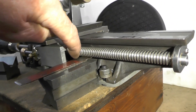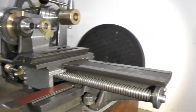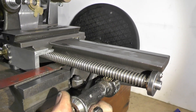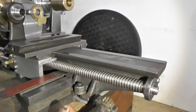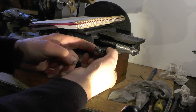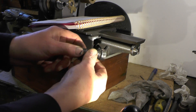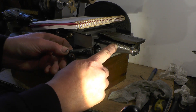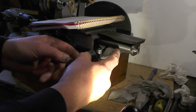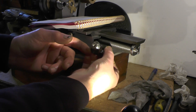I ain't got a lot of room in here to play around with, so I've got a bit of faffing around to do. Plans can change, so I'll have a think about this and then probably start making a gear up and see if I can come up with some dimensions for a little gearbox. That's the Myford threading dial that they put on the lead screw — it's got the same pitch as the one I've done, but on the Myford it's a bigger diameter lead screw — three-quarter inch versus my half inch — but that spare gear seems to work fine.